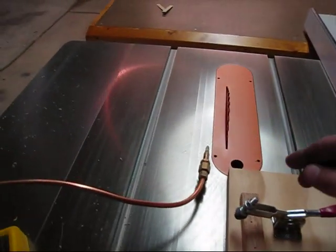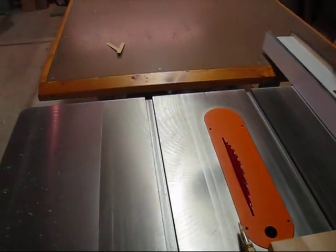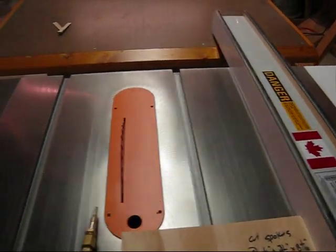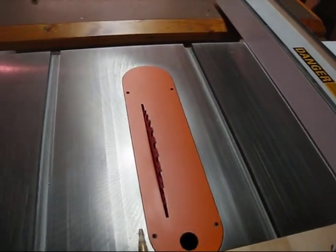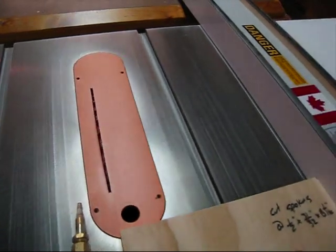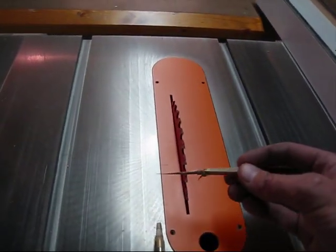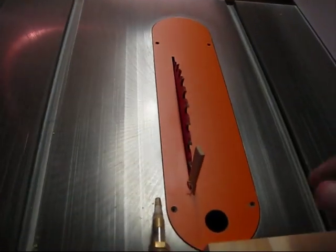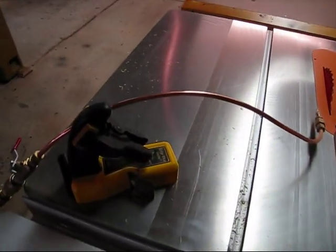And the wedges, I already switched throat plates once. I had the original throat plate in here, and every once in a while one of those little wedges would get shot through the throat plate. So I put the zero clearance plate on there, thinking that would help. But every once in a while it still comes back. Like here's a shim right here. It'll get shot back and it'll get wedged in there like that. So I've been wanting to make this up.